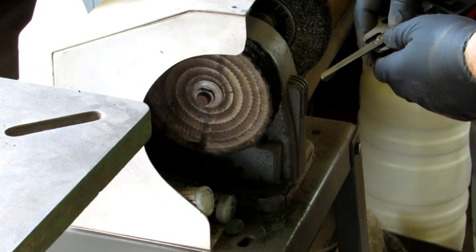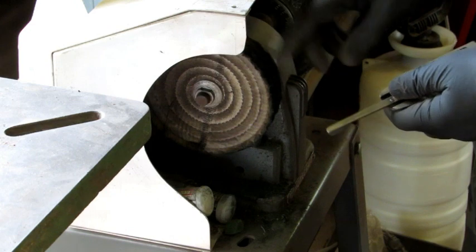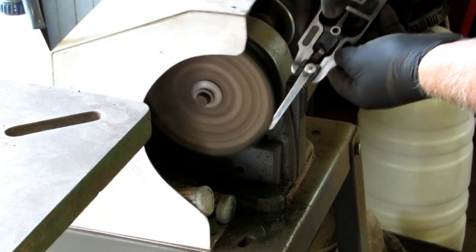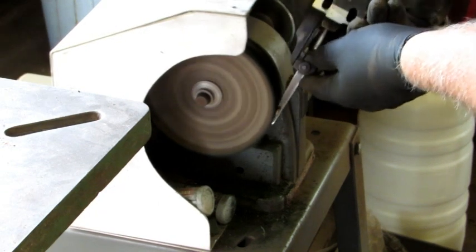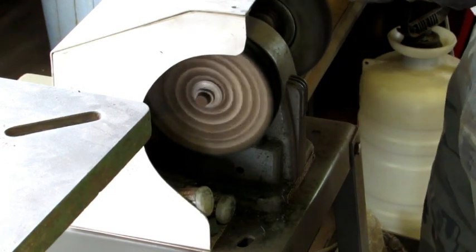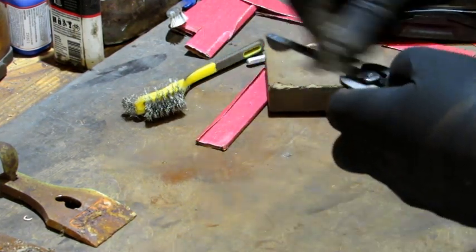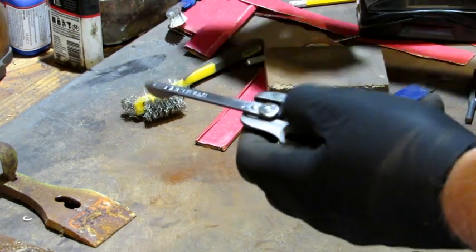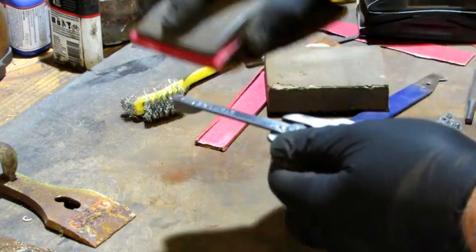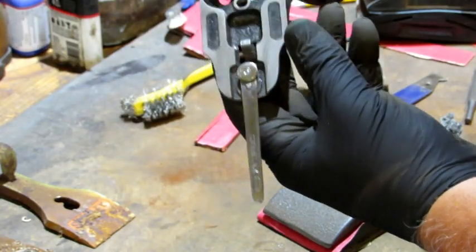If your 3000 grit paper wasn't enough on the lateral, you're not happy with it, you want a little more shine, put it on a buffing wheel. That's it. After the buffing, you're going to want to take some steel wool to it to clean some of the buffing compound off. Back to your sandpaper, if the buffing compound hits the machine surface of your frog, to get it looking back like it's supposed to. There she is.